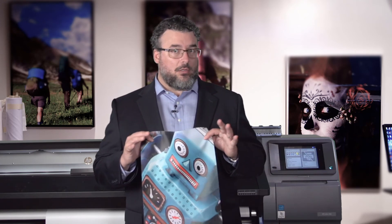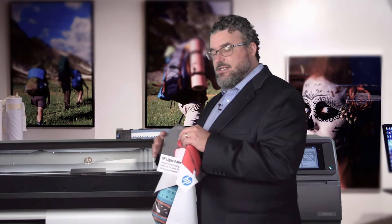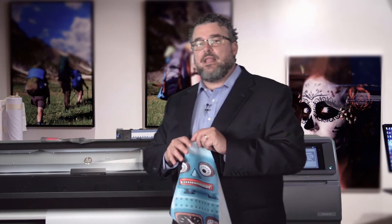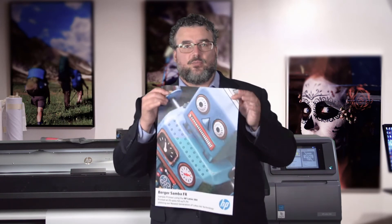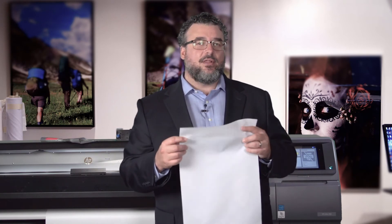This particular product does not run well at all when you put the ink collectors in. What happens is it actually dips down into the ink collector and doesn't allow it to lay nice and flat across the print platen — you will get sort of elongated text. With the Samba material, two things are true: you're going to have to use the take-up reel because you need tension on this thinner material, or it's just going to fall or fold on itself while it prints.